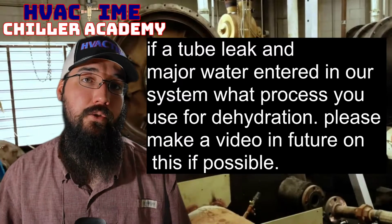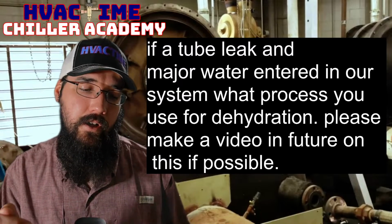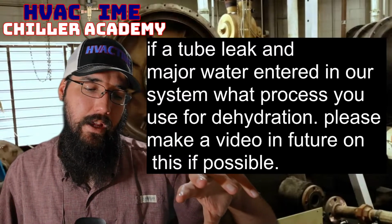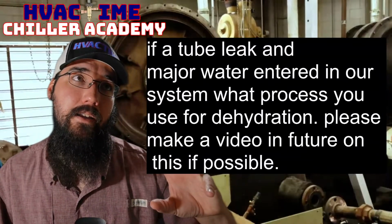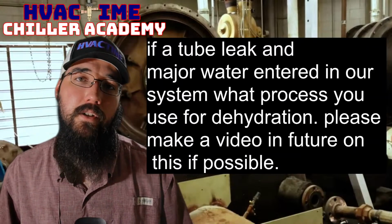Then we had to put the chiller through a dehydration process, and there's a couple of ways of doing that. You can either do a nitrogen purge to dehydrate that way, or you can just do it through evacuation, doing triple evacs. And depending on the scale of the machine, using a cold trap can be really, really beneficial.